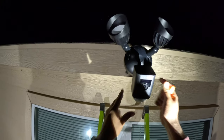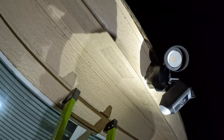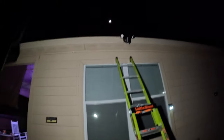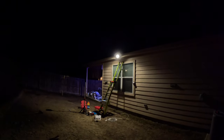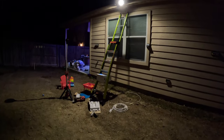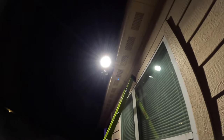After it's mounted, we can take the plastic off and bring the heads down to get them prepped for when we turn on power. Quick recap: we had constant power going to the receptacle in the attic, we tapped off of that receptacle to feed this new floodlight. So now we can go ahead and turn on the breaker and see if we have power at the floodlight. As you can see, the ring floodlight is blinking with power. The next steps are just to go into the Ring app and connect it to your Wi-Fi and get it all set up. I hope you guys like this longer video — I tried to get it more detailed so that people that have never done this before now know how to do it.